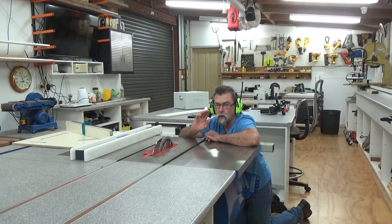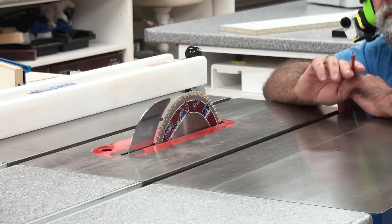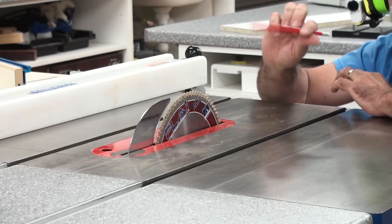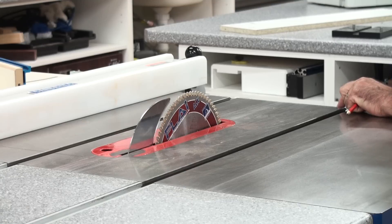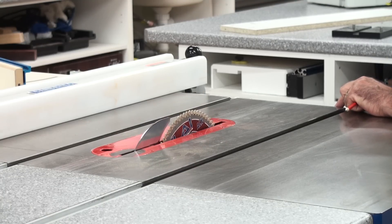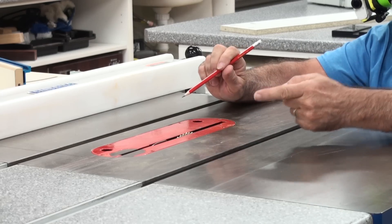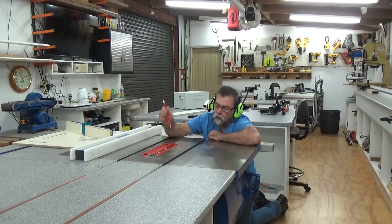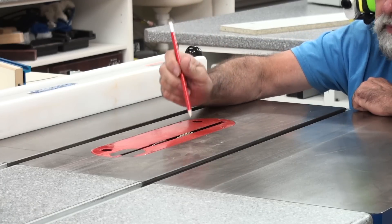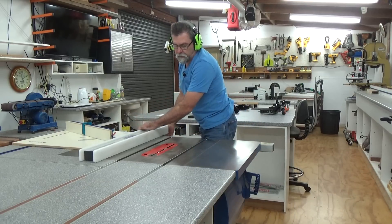I'm going to wind this blade all the way down. I haven't got a blade guard on here at the moment because you can't really use one this way unless you have one mounted on the roof and lower it down over the top. I'm going to take it down to around about two millimeters. The reason I've taken it this low is we're going to score the underside of the board. Because the arc is extremely shallow, we're not cutting down and tearing out the bottom — we're just going to do a scribe. We'll run a bit of melamine through to start.